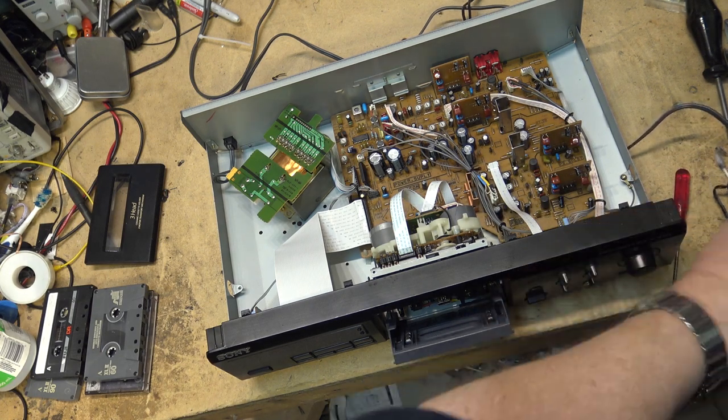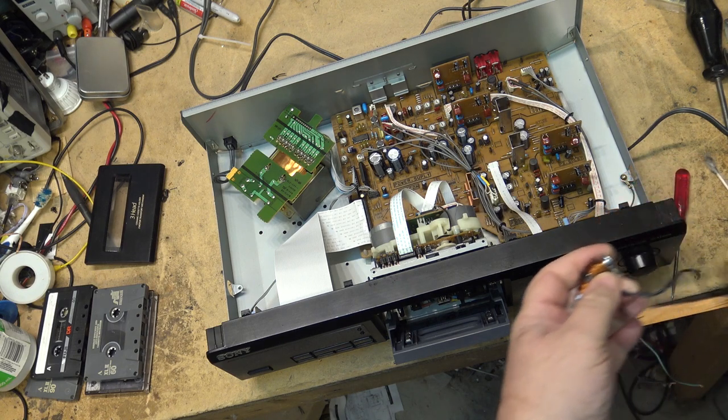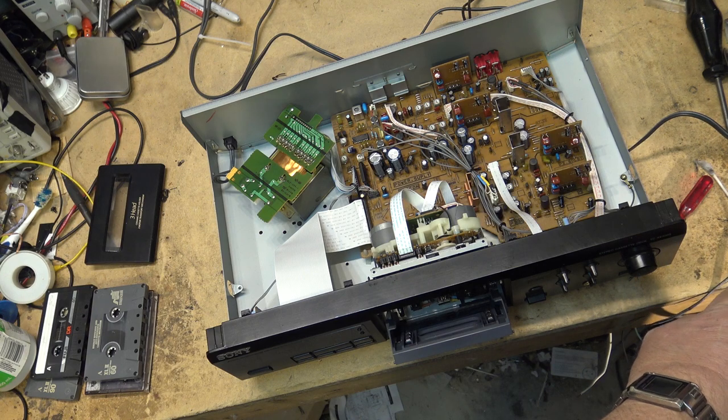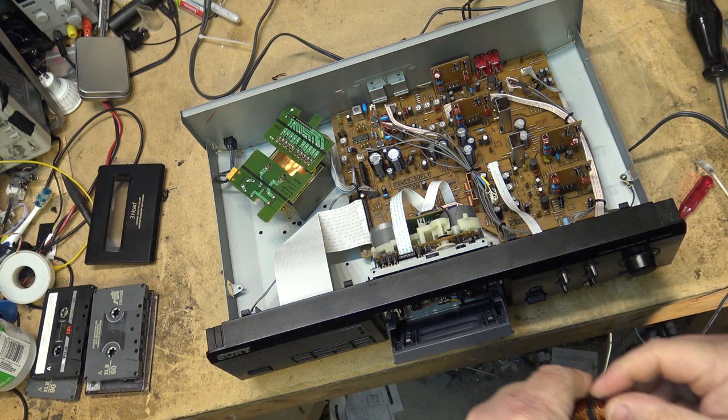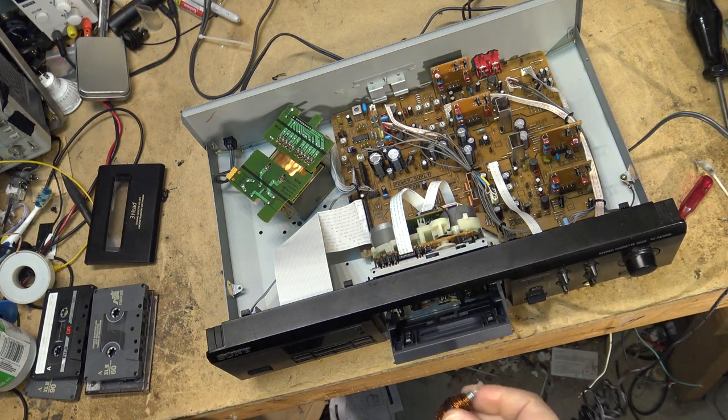I'm going to plug this thing in. I'm going to give the heads just a once over with my little demagnetizer here. Mine is overkill because I'm driving way too much current into this thing. This will actually get hot. If I leave this thing plugged in for more than about a minute, it'll actually get warm.